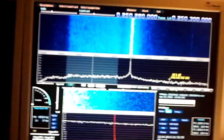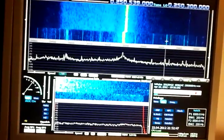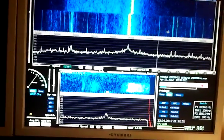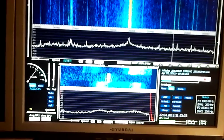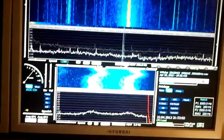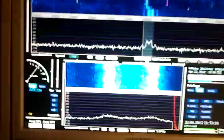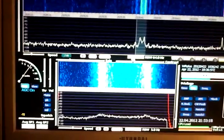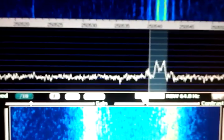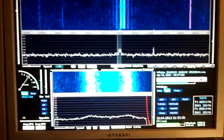So let's go to some pre-recorded IQ files. First of all, the beacon signal I explained before — which is actually this signal here. In order to see the signal to noise ratio we have to zoom in, since we are seeing one megahertz bandwidth now. I get some audio dropouts due to high CPU load, but what we see here is approximately 10 dB signal to noise ratio — a little bit higher even — so exactly the same as on the FunCube dongle before.